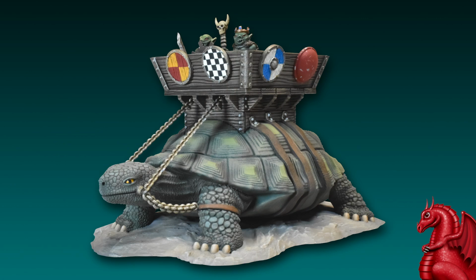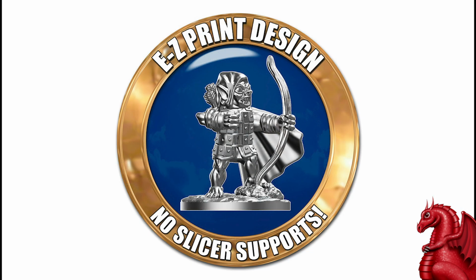In the case of things like the war turtle, that is a multi-piece print. And that way it can print supportless. One of the drawbacks to FDM is if you have a lot of overhangs, if the model is not designed for FDM printing, it can create some hassles for you. I know my company, Fat Dragon Games, everything we design is designed to print supportless for FDM, and there's other companies that do too, and usually they will designate their models as such.